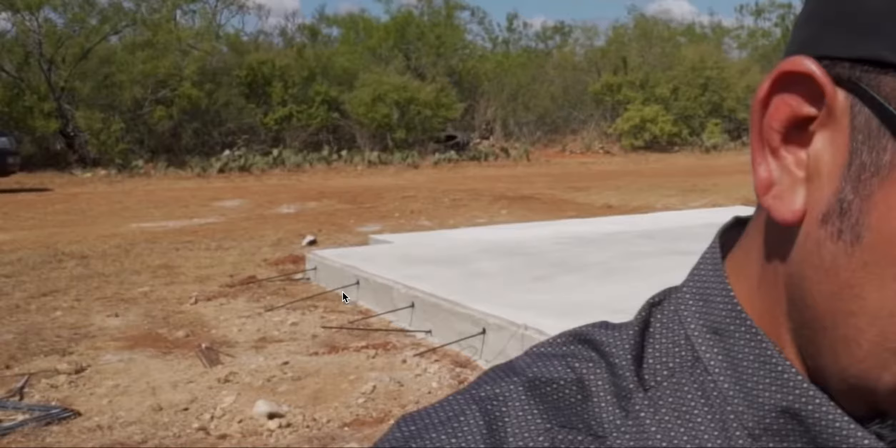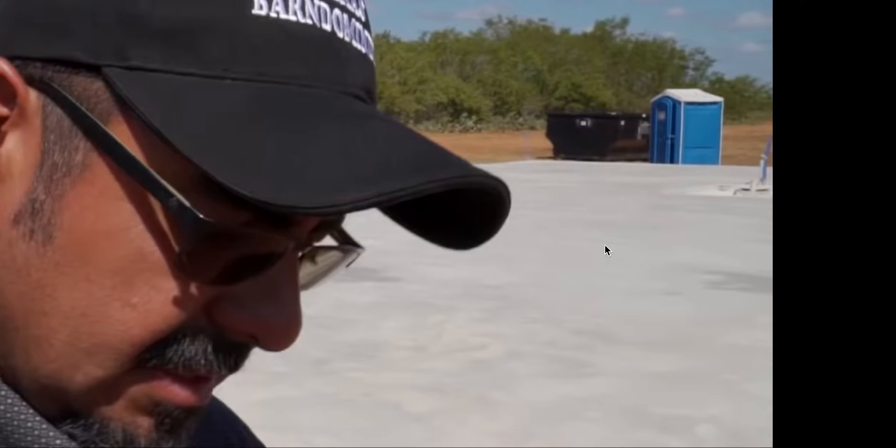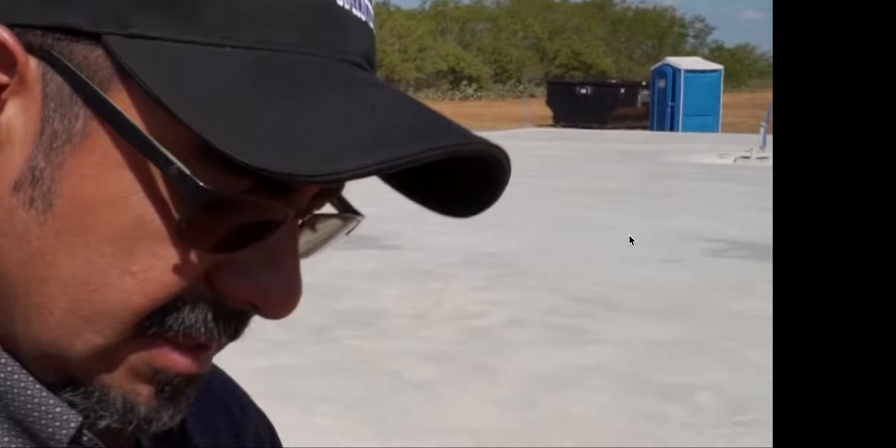I would even go as far as saying putting a protective layer of concrete out here, roll rubber roofing — the real rubber roofing — anything that gets the water away from this foundation and puts the pooling somewhere else, away from this foundation, and you should have no cracks. Any other cracks are just craftsmanship issues — you didn't let it cure properly, things like that.